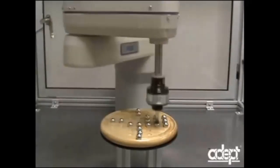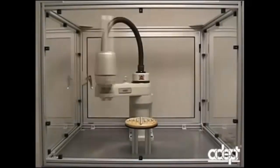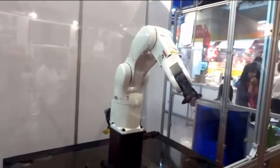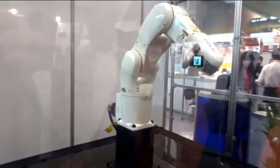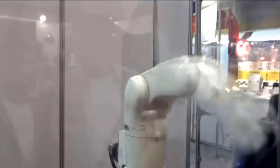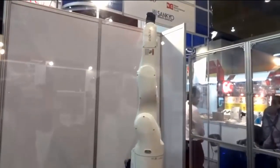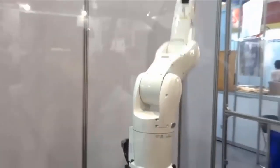However, we will often find that the number of degrees of freedom — that is, the number of joints — is not limited to three. In fact, many of these manipulators have as many as six degrees of freedom. In this section of class, we're going to learn why this is: why is six degrees of freedom a good number to choose for your manipulators, and how can this be accomplished? In particular, how can we accomplish building a six degree of freedom manipulator while also still avoiding kinematic redundancy?